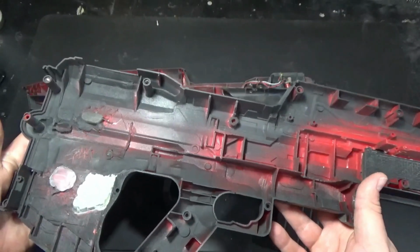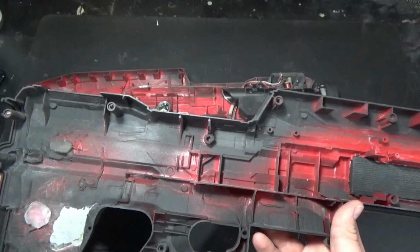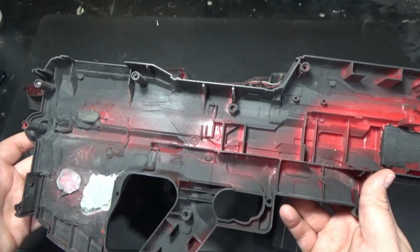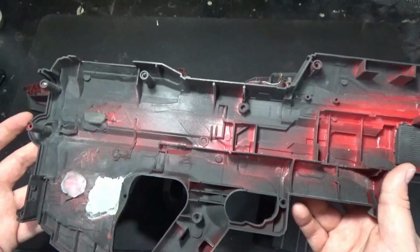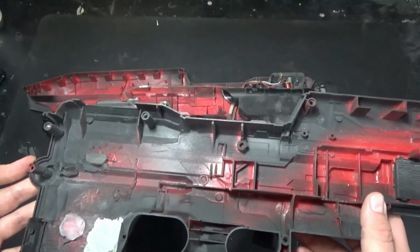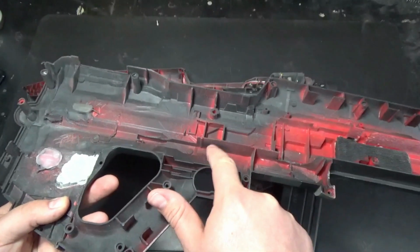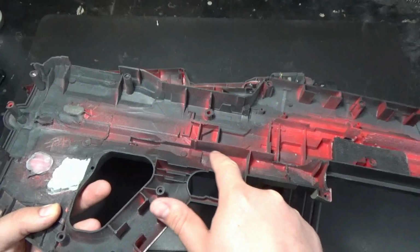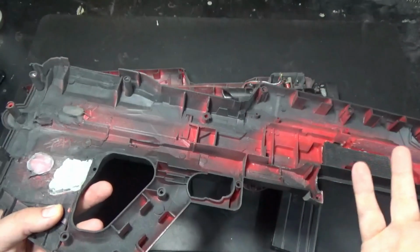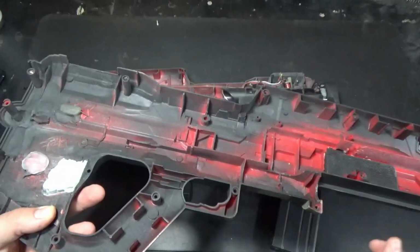All this was done with a Dremel, with a sanding head and a 2-flute, I guess, end mill cutter. I found that using the end mill cutter to remove the majority of the material, so you just cut along, take out that big chunk, and then you can follow that in with the sander head just to clean it up, worked the best.